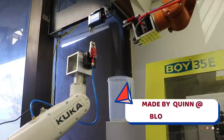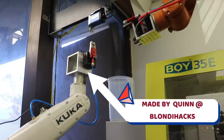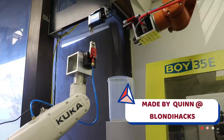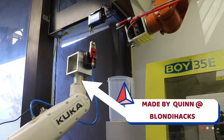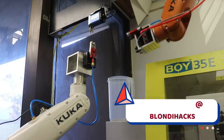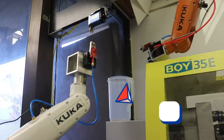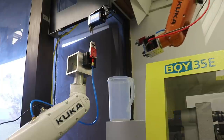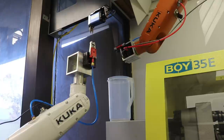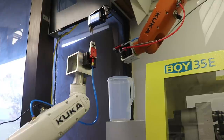So I am still in teach mode with the orange robot. And I'm down at the last line of the robot before it goes back home. So manually, I'm gonna instruct the robot using the joystick or the XYZ commands to come over to the scrap bin. It may come up a little bit in Z, and then go over so that our claw is basically in the middle of our bucket, like so. And then I'm going to tell it to teach this position.